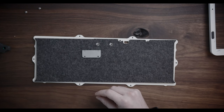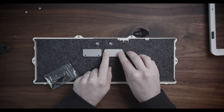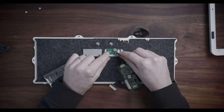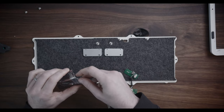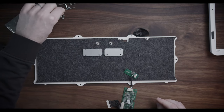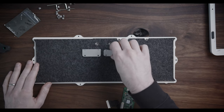But it's a worthwhile thing to note that these two screw holes here, on yours it'll look like this, are quite small and very fine threads. They unfortunately have to be because of the size of the breakout PCB and the positioning of the parts. There's no other way to screw it into the adapter plate. So we have to use a super, super tiny screw. And threads like that in metal are very sensitive. So just be careful not to over torque the screw when you're attaching it, because you can destroy the threads as I have done on this plate. For whatever it's worth, if you do that on one of them, it's actually totally fine. You can survive with just one screw, but it's just something to bear in mind.